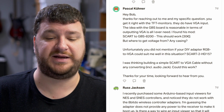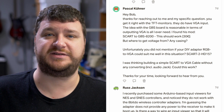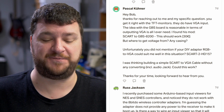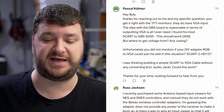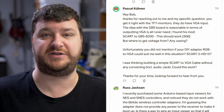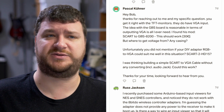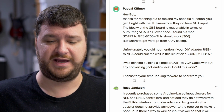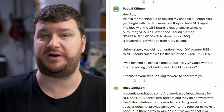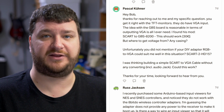Now, because you're making 10 of them, I don't know if that's the best option for you, because that's just a lot of soldering, a lot of parts to make. It's certainly a very nice solution, but what you might want to look into instead is, as you suggested, just building a basic SCART to VGA cable. And all you would need to do is get SCART receptacles from AliExpress or from Console 5, and then any shielded VGA cable, get like a shorter one in length and just cut it in half. So nothing gets wasted because you're using both halves. But then you could wire all of that together.